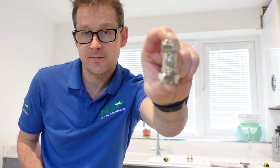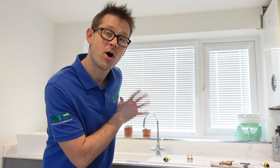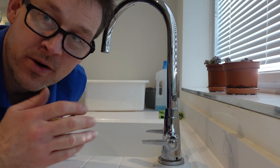I had isolation valves so I've turned those off, opened the tap, and any pressure has been released with no more water running out. If you're using a stop tap, turn it off, then open your kitchen tap and every other tap around the house — downstairs toilets, bathrooms upstairs, hot and cold — let them run until they dribble to a stop, which can take two to five minutes. Top tip: get the sink plug and push it down so any fiddly screws you drop don't end up down the drain.